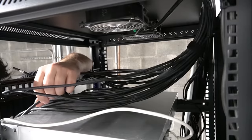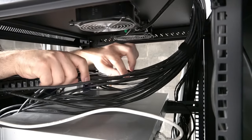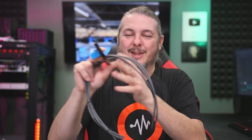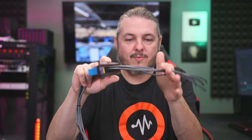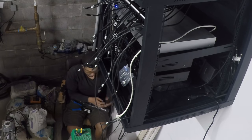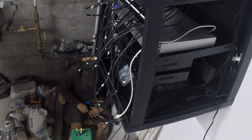When you're pulling the cables through — and we have some of this on video — an important aspect of keeping everything nice and neat is trimming. Just like when someone's cutting hair and uses a comb to pull all the hairs straight, it works much the same way. I quickly crimped this with some zip ties — I know, blasphemous — but that's because I'm throwing it away since I'm done. Ideally you want them to be the same length, so trim them out, leave a little bit of slack. Pull them out, snap on all the ends, pull them back in. One advantage of a big service loop is that after pulling it through the rack you can sit in a chair and comfortably snap everything together, then work them back up and pull the slack out.